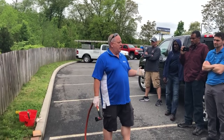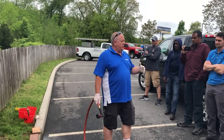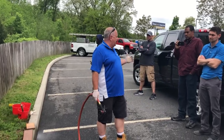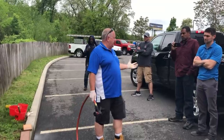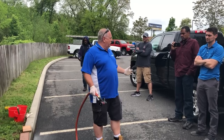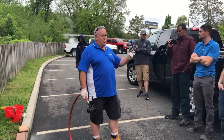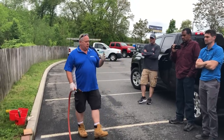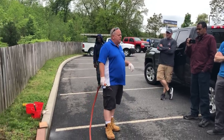Great for somebody working at home. They want it to dry. They don't have the patience for some of the longer drying oils, like paraffinic oil that's commonly used in Baker's Gray Away, TWP, and some other ones. So not all oils are the same. Those film-forming oils are going to be harder to get off. That's why the dwell time might be 30 minutes when you're actually taking the coating off.